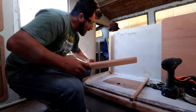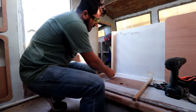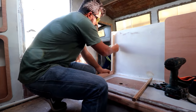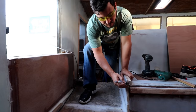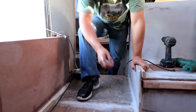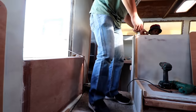It looks like that now. We'll take that second one and meet it in there, then do an epoxy fillet on the inside. Get rid of the paint, do an epoxy fillet there on the edge. So this is the edge now and I left that little bit of overhang. What I do is take that marker, mark it up, take it off, and then cut precisely on that line so I'll have the same edge.